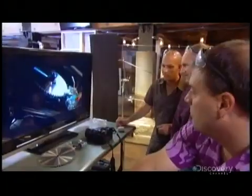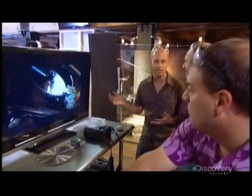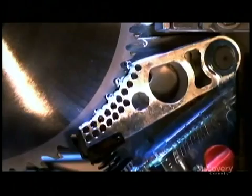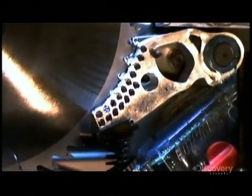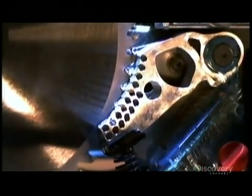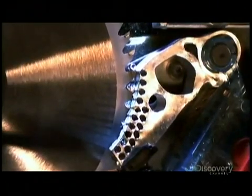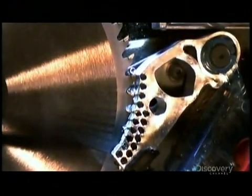The machine is not happy about this fact. Any way that this asymmetrically hits the weight, it's just going to put huge torques. You're slowing this thing down at a thousand Gs — we just have no human reference to what that means. That's like driving a car a thousand miles an hour and hitting a concrete wall, and it's just flapping like it's a piece of paper. 5,000 RPMs is a lot of energy. The energy has to go somewhere when it stops, so it's transferred to the soft-stop module, which acts like the crumple zone in a car. The module and saw blade are now officially trashed. But hey, at a cost of about $60, better to pay that than with a finger.